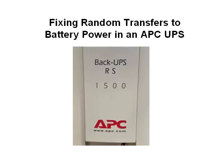There were occasional voltage spikes on the AC, but they didn't happen at the same time the UPS switched over. Gradually, the random switchovers got more frequent, and then finally the output to the desktop computer started dropping out during these transfers, which desktop computers don't like. If you've ever had your day ruined by losing all your work when the computer suddenly dies and restarts, you'd know that's when this UPS had to come out of service.